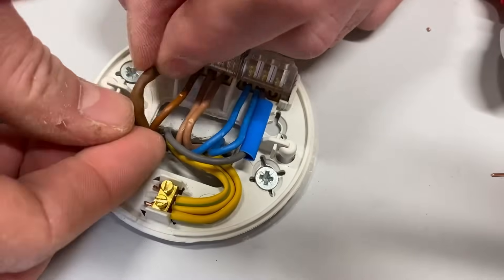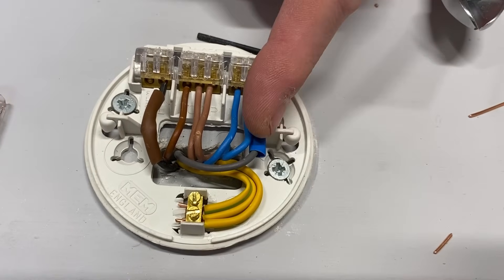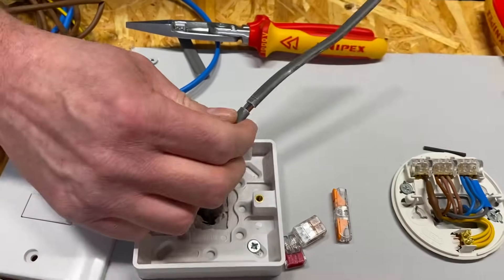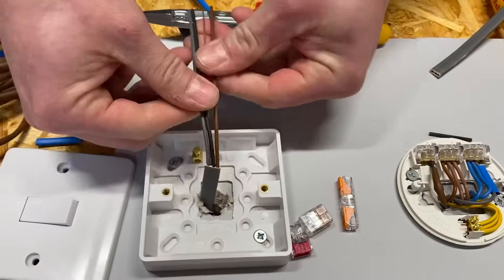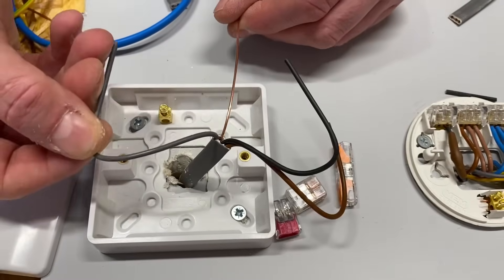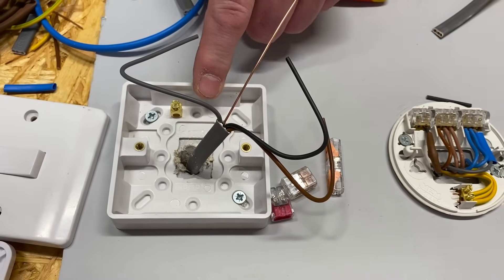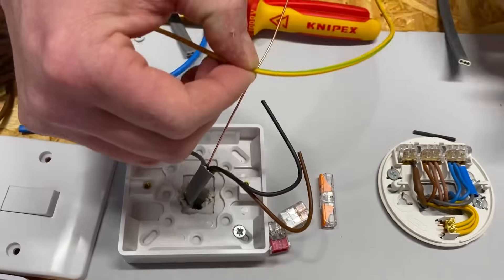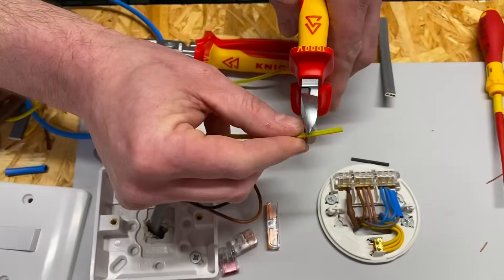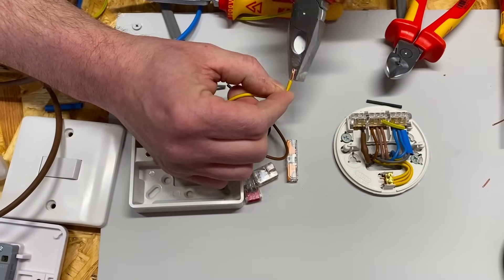My switching line connections are made off in my ceiling rose. I've done nothing extra effort-wise as an electrician — I've just put a three-core-and-CPC instead of a twin-and-CPC, meaning I've got a floating neutral when I get down to my switch. Let's look at the switch now. I've got my three-core cable down here, strip that back. We've got a permanent line that will go in common, a switching line — remembering that's the black one — a neutral we don't need but is there for the future, and a CPC. Let's get rid of the CPC first.